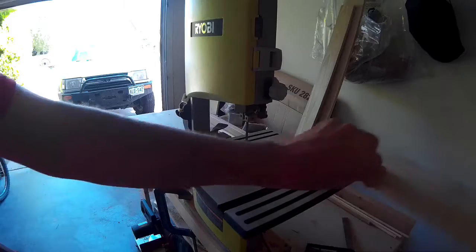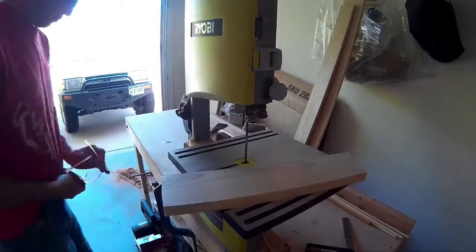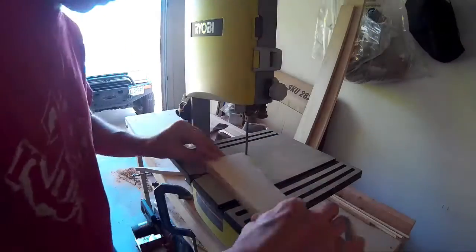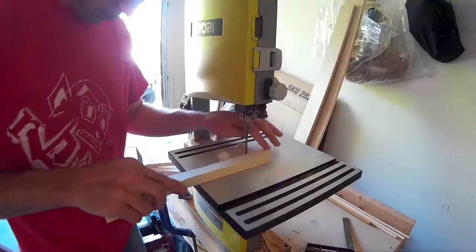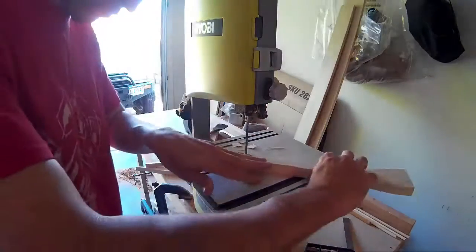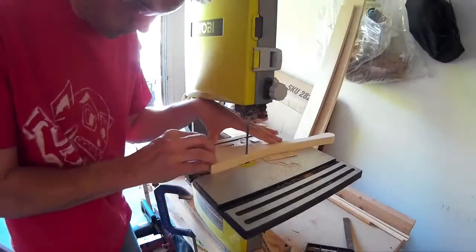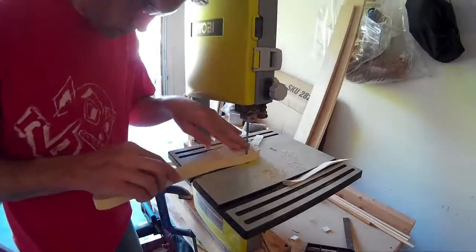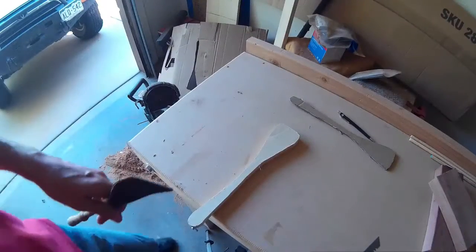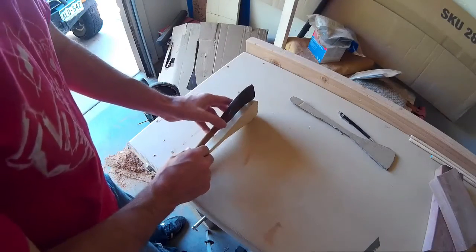Here I'm just cutting off that little piece. Once you do that, you will just cut out what you need from the board and then trim around the drawing that you've already made — the outlines. I did this pretty much in three stages. I trimmed not real close to the line, a little bit outside, and then went back and re-trimmed closer to the line. I'm still getting the hang of this particular bandsaw, so I went step by step.